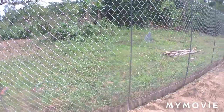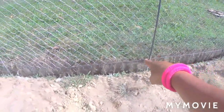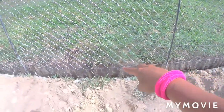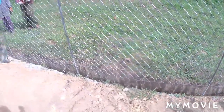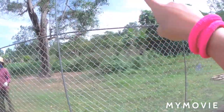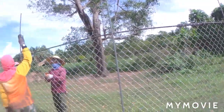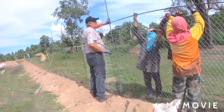From there down below they put the 9mm rebar to hold the interlink in place, and then we pour concrete down there to hold all the interlink wire. And I think if my sister comes, I'm gonna have her bring me a solar electric box and run a wire to the barbed wire. On the top we're gonna put a barbed wire so it's much safer for us for security purposes, because you don't know what will happen.